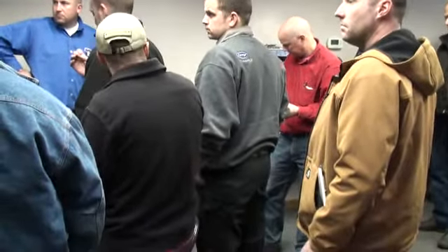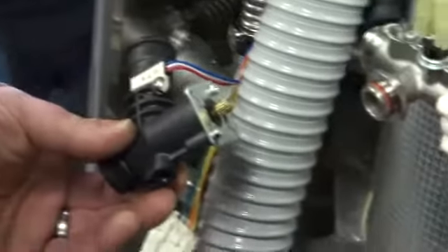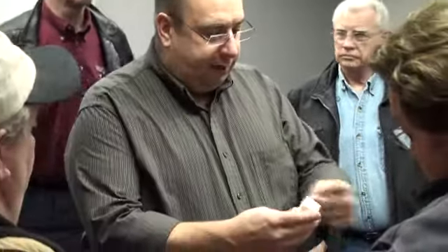If you get to a house on a Saturday and E27 will not reset, here's what you do to get them by for the weekend. Take the head off just like this. When you look at that valve, there's a brass fitting on top - you can spin that valve and see the seat go up and down inside it. Take that valve and close it all the way - turn the seat so it closes the valve on that brass fitting on top. You can do it with your fingers. Then plug all the stuff back in but don't reinstall the actuator head back on top of that machine. Put that back in place without it installed, then turn the number five dip switch on and they'll have on-demand hot water for the rest of the weekend.